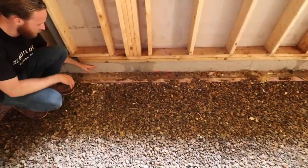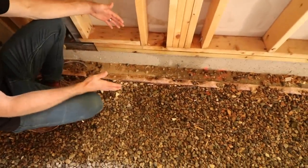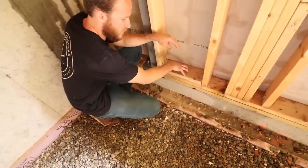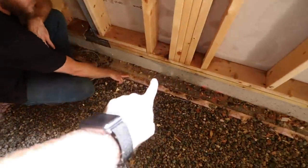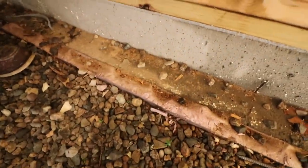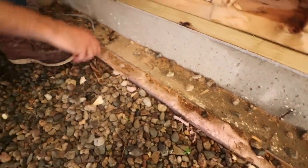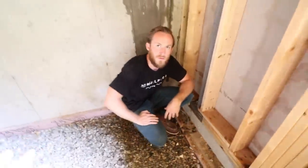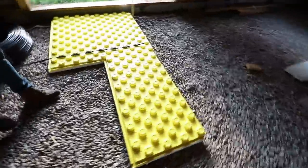The stem wall in the back of the house is that deep as well — we take those forms and drop them down. Then we're here — this is our footing with a small six-inch wall. We shrank from a ten-inch wall to five-and-a-half to catch this, and then there's a small shelf which allows us to pour our slab up against it. We have two inches of rigid foam right here, because on the walkout side that ground is going to get cold and we don't want that cold transferring through the wall. Then later we'll pour the basement slab — and that slab will also be insulated.